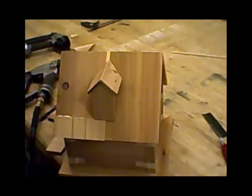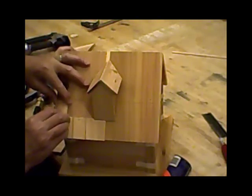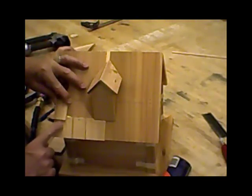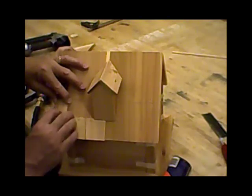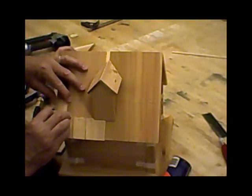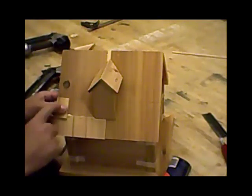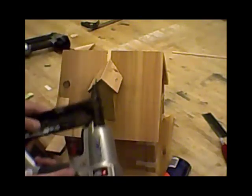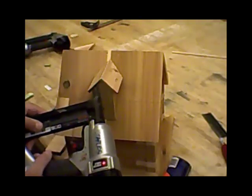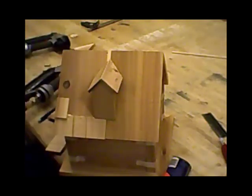Now I have the line drawn all the way across the roof on both sides, so whatever pieces of shingle I put on here are going to hit right on that line. When I put this one on, I'm going to put glue at the top of the shingle but not down at the bottom. If I put it down at the bottom, it will tend to run out over. If you do decide you really want to put some glue on the bottom part of that shingle, you just can't put very much because you don't want it to run out on top of the other shingle. Line the top up, give yourself a little overhang, line it up, and shoot your staple. Avoid using too many staples. If your staple goes in and splinters it, the air pressure is too high or the gun is shooting too deep. There's a little wheel below the trigger that you can turn one way or the other to control how deep the staple goes.